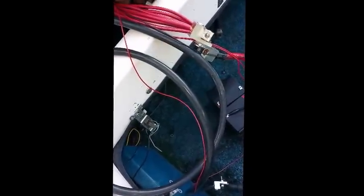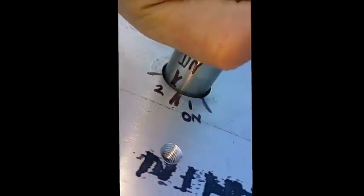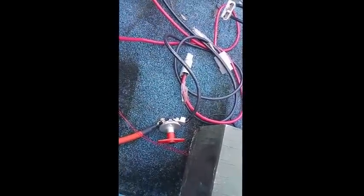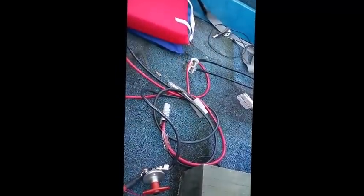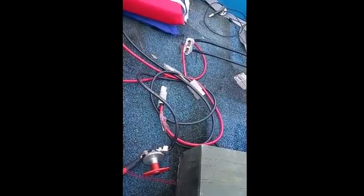There are two LEDs here. You can see that one's faintly on when I change the position — that's position one, position two. So now the other LED should come on; you can see that's on instead. I don't have batteries hooked up right now — we're going to run that later on the water. But so far when I ran it, it kicked off at 24 volts with 150 amps when I was bridging it with that smaller wire, then it evened out at around 70 amps. It was kicking.